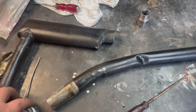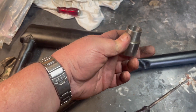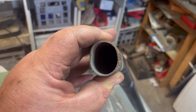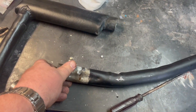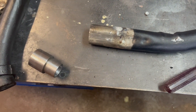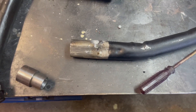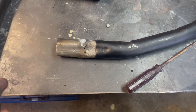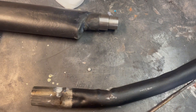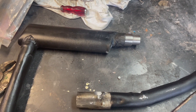I made up a little adapter for the exhaust pipe that was going to slide in there, and the new exhaust was going to go on — all simple. Except it's oval. Agriculturally oval. I don't really know why somebody made the outlet of the silencer oval, because then they crushed a piece of pipe to get it to fit. On a bright note, it wasn't welded in — just pushed in — so with a bit of heat on the exhaust pipe and a hammer I knocked it out. I've just been trying to round up the outlet to get that slug to fit, and I think I'm going to win the battle. I'll quietly plug away at the anvil and get that slug to fit before I weld it in.